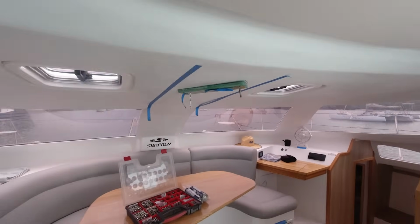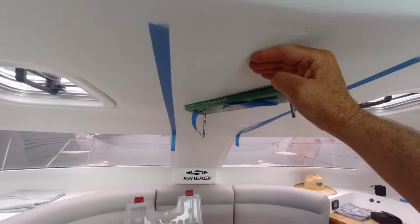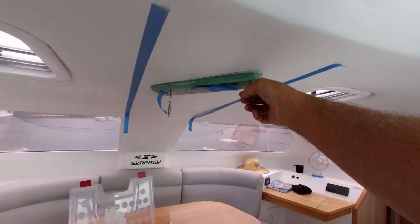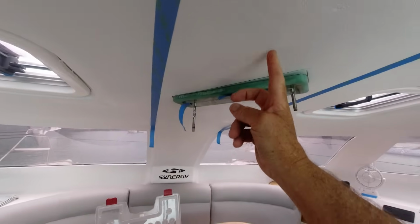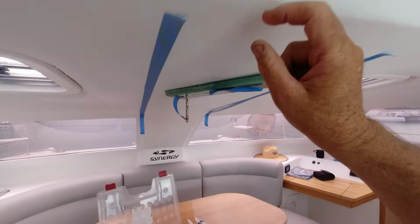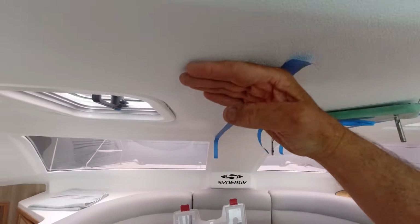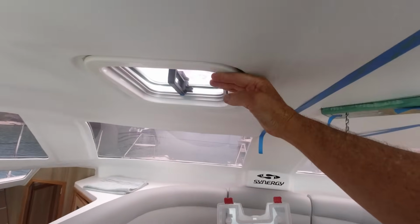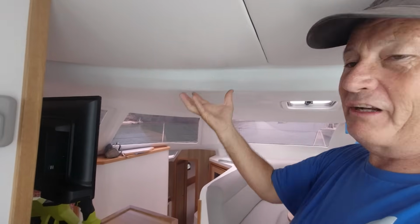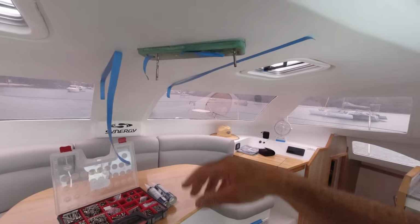What I now need to do is put in this huge G10 block up in here, but unfortunately I can't leave it sitting there because it's going to knock people on the head, particularly with bolts sticking out of it, so I need to recess it back into the foam, which is about 25 millimeters thick here. That'll give me enough room to put a small liner over, which will sit flush with the height of this, so it'll resemble this idea where it's recessed in, and Janet will do some sort of padded liner like this to fit over the top of it, so we can always have access to the nuts and bolts, bringing that deck organizer down through the roof.